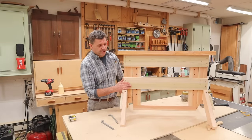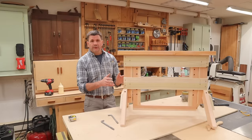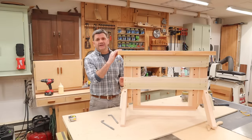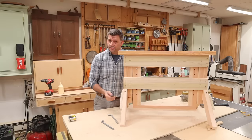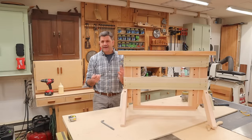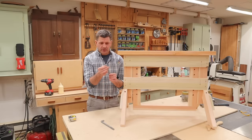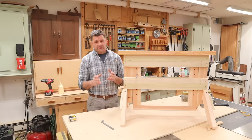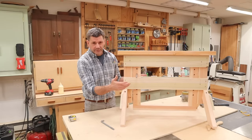Just a few builder's notes before we wrap up. Don't forget there are plans for this project — just click on the link in the description below. I built the horses out of Douglas fir for the 2x material — that's the 2x4 for the legs and frame, and a 2x6 at the top, all Douglas fir. For the bracing I used poplar; you could also use pine or even plywood. For the adjustment pins, these are anchor bolts — I could only get 8 inch long ones, which are kind of long. The only part of the anchor bolt that's a half inch thick is the threaded part, so if you cut the threaded part off it'll go in and out of the adjustment holes a little bit easier. If you want to lock the pin in place, try to get a shorter anchor bolt and put a nut on it.